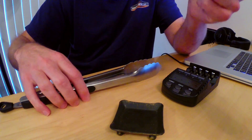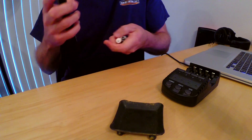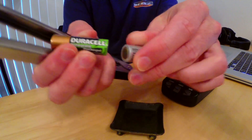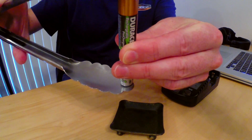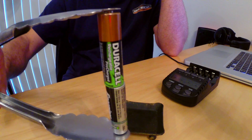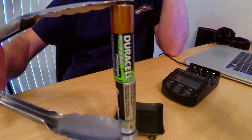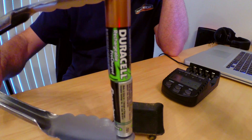What I found was easiest is to take a pair of barbecue tongs, which are metal and will conduct current all the way through from one side to the other. Then I take the two batteries and connect the two negative sides together — I only do this because they're flat and it makes a really good solid surface. You take your two batteries and connect them together with your barbecue tongs just like that, and let them sit there for about 30 seconds. That charge is not controlled, and when you're charging nickel metal hydride it's good to have some smarts in your charger, which we're not applying right now — but we're only doing this for about 30 seconds and no more.